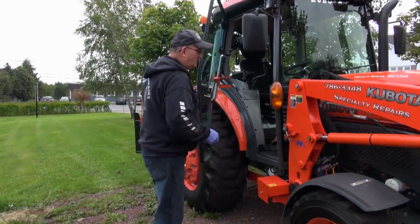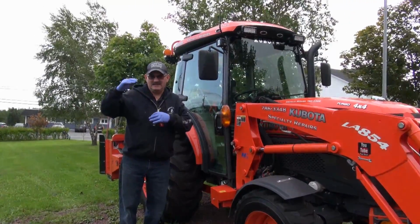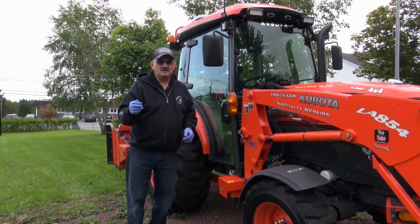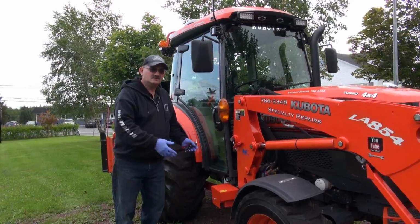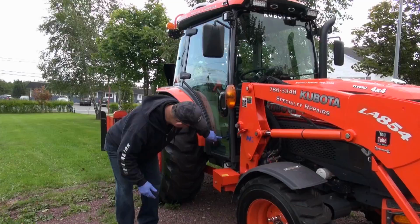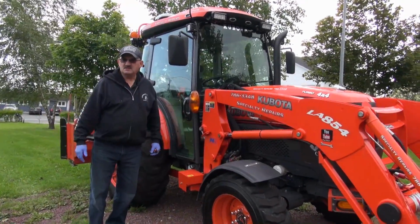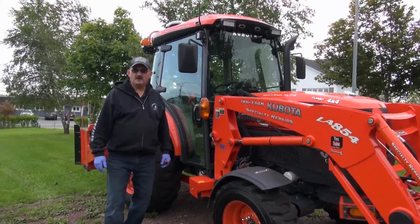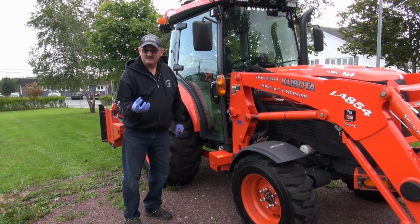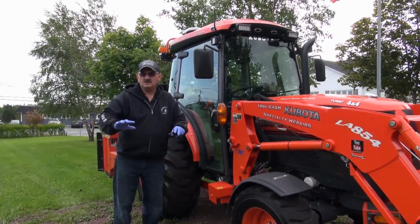That's one of the things. I'm going to attach all the pictures, including the fix, at the end of this video, so you'll be able to see exactly the steps that I took. Now that you see the problem, they're susceptible to corrosion, big time. This 40 series pedal is flashed over with plastic or rubber, while the new 60 series is just bare aluminum. If you're out in the salt and the snow, every time you put your foot on it, it starts to corrode. Also, down on the bottom is the only place there's a hole in that mat, and that's where all the water gets in. The floor was starting to get all cruddy, full of aluminum, an awful mess.